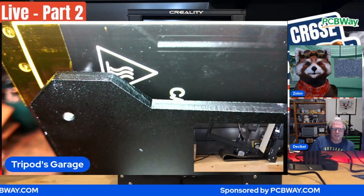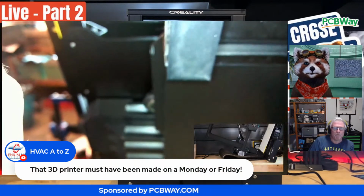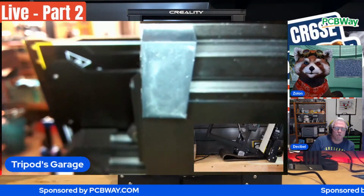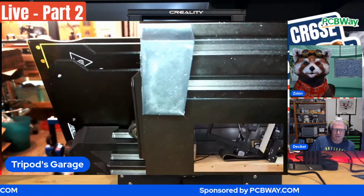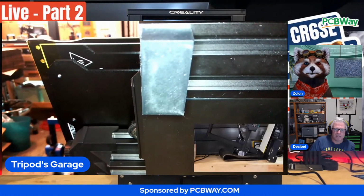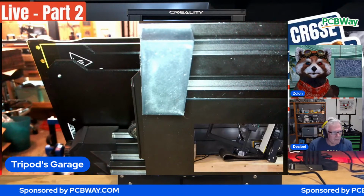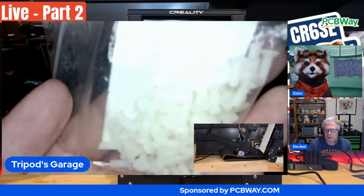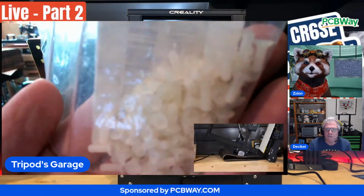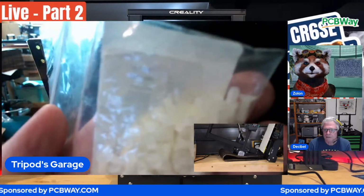And as the clamps are metal, both front and rear, the clamp will actually ground the 24 volts to your aluminium bed plate, and the voltage is carried through the ground into the chassis and causes damage to your components. And it's very well explained on the Reddit thread. I'll put a link up for that right now, and you can peruse it at your leisure.